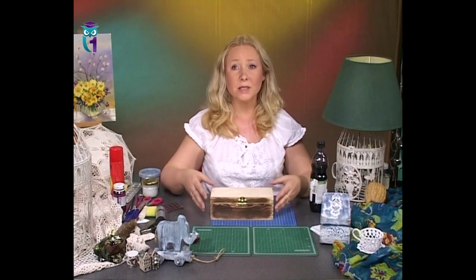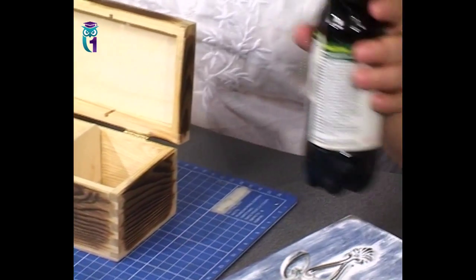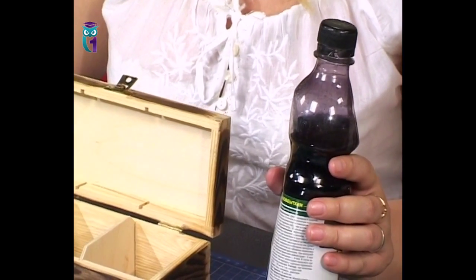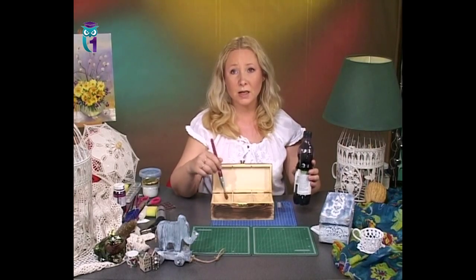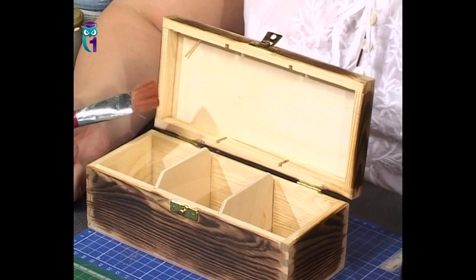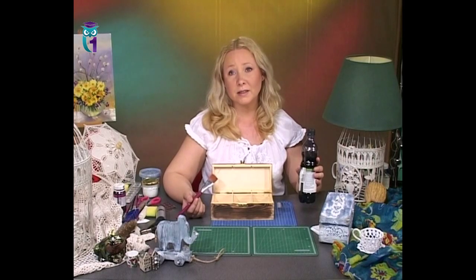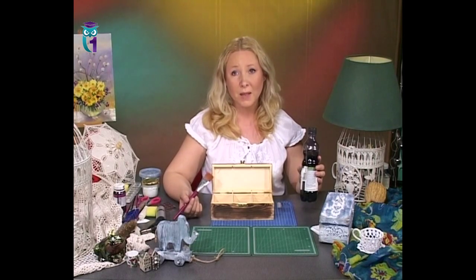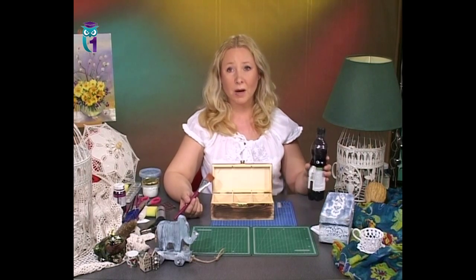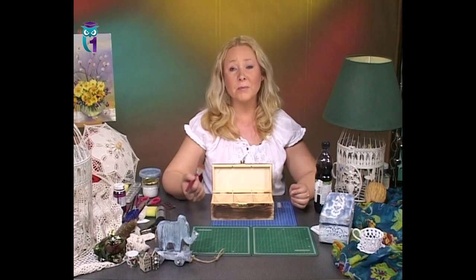So, before beginning the decor of the casket, I suggest trimming it inside. We take water mordant or an ether of the color you liked and apply it by means of a brush on the bottom, cover and casket partitions if there are any. I use for work mordant of the color of ebony tree. I very much like this color and working with mordant, as we can regulate the depth by repeated application. But it's necessary to do it in 2 hours. This is the time of interlayer drying.